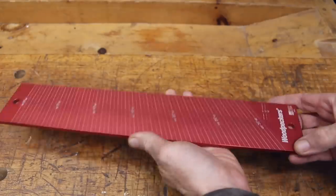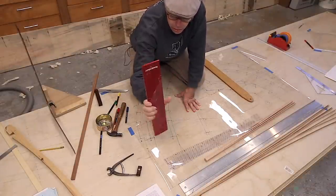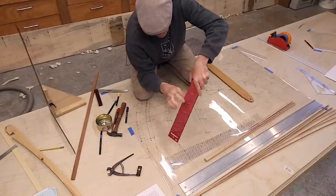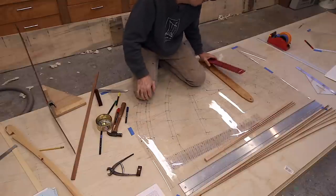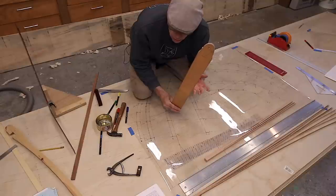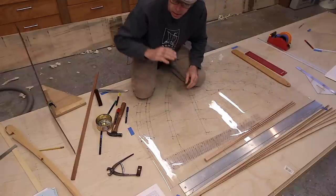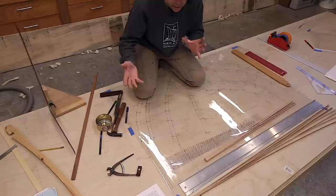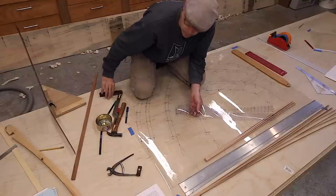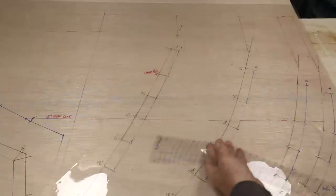This kind of bevel board is something we make in boat building school — we make it the same way using a big master bevel board, laying a piece of stick across and drawing a bunch of lines. The Woodpecker company made a really nice little bevel board — I don't know if these are still available — but they split the angles from zero to 30 degrees on one side and then 30 to 55 degrees on the other, with half-degree and quarter-degree markings. It's a great little tool, though I don't use it as much because it's heavier and bulkier. I don't really record numerical angles myself very much — recording them works great when you're working in a team and calling out angles, or you've got saws set up with protractors. I tend to just bring my square over to the bandsaw and set the bandsaw to whatever the square is saying.